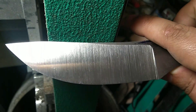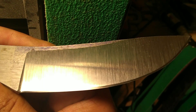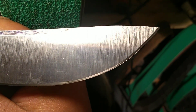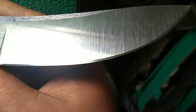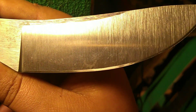People that want ultimate durability — that production side is probably going to be for you. But it's not going to cut as well; it's a trade-off. When it comes down to durability, it's really not about fancy steel — it just comes down to geometry. If you want the most durable knife, use low-alloy softer heat treat, like 56–57 HRC, keep it nice and thick — 40 thousandths behind the edge. You're not cutting anything at that point anyway. It stops being a knife at that point.